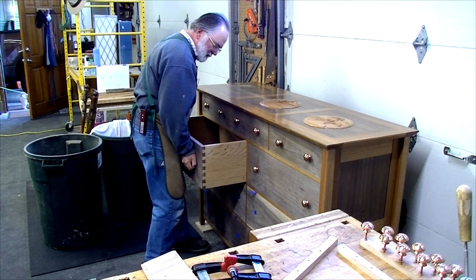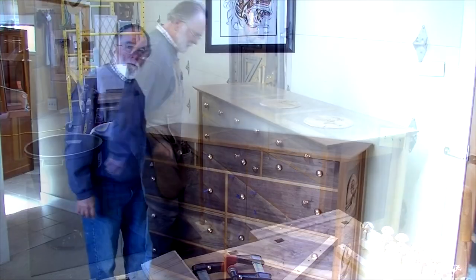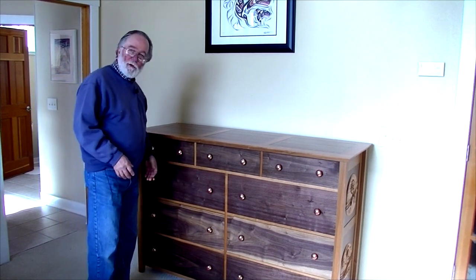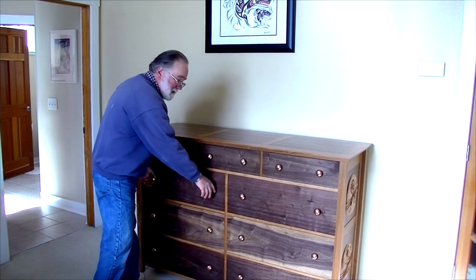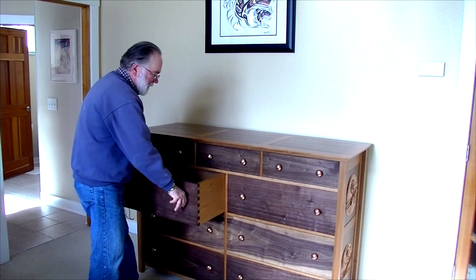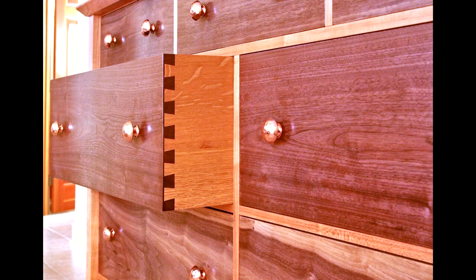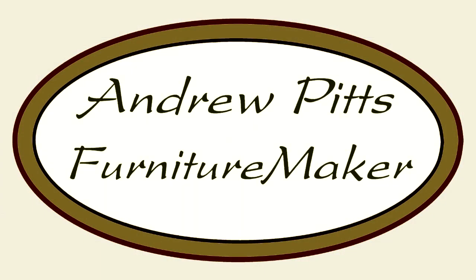It's going to be a little stiff because there's no finish on the drawers and they're not lubricated yet. With the help of some friends we moved the chest into the house — and this is what it looks like completed. I really wanted to show you how the drawers work after putting some lubricant — it's really night and day. This is the same drawer I just operated dry in the video, and now this is how it operates with lubricant. I hope you've enjoyed this video of making a chest of drawers, and thanks for watching.